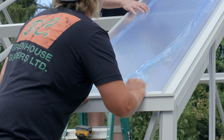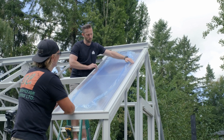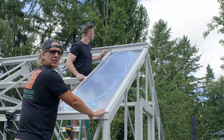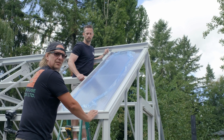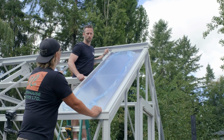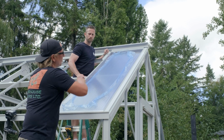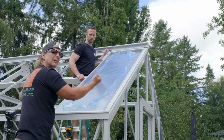Okay, we're in. So my H is tight to the bottom of the gutter. We've got good spacing, we're looking good. And if you find that your roof is sort of out of kilter and not fitting well, this is the time to do it, not 4 bays in. So if we had to send the ridge this way, Greg at the top would jerk the ridge so we get this nice and straight, or bring it back.